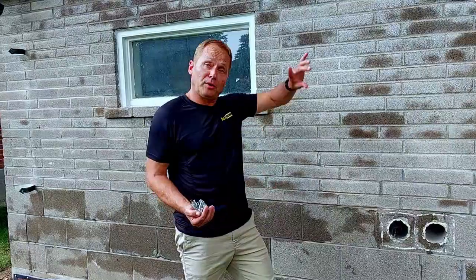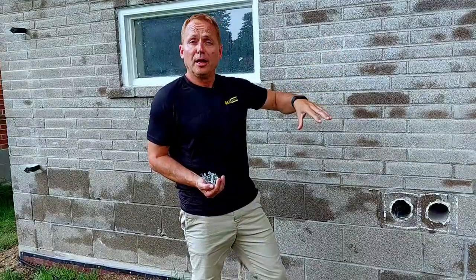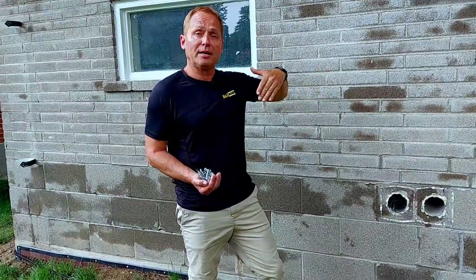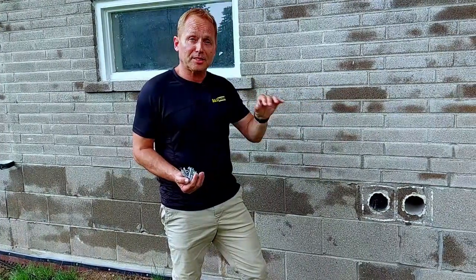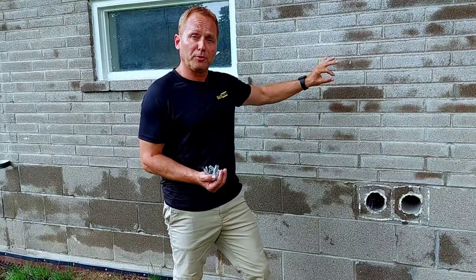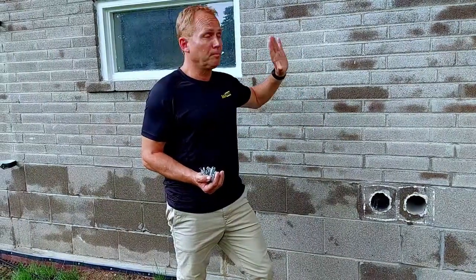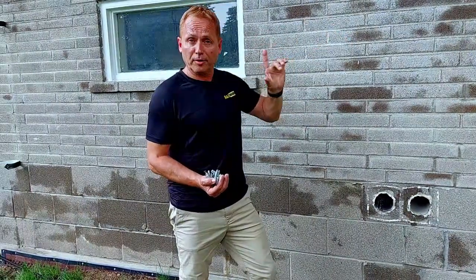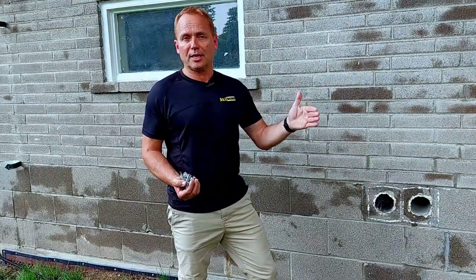On this part of the house, and actually around the entire house, we're taking out all the anchors which would clip on for cable and wires over the lifespan of the house. When you do that you have holes in there. Now if you've ever experienced ants or insects getting through the masonry, that's just one typical way on how they can get through. So once we fill those in with a little bit of mortar and seal it with LiquiStone — one coat, two coats — that's going to be impenetrable for not only the rain but the insects as well. The nice thing about LiquiStone is that this homeowner is going to be able to choose whatever color they desire and it's going to completely transform the entire aesthetic look of the house.